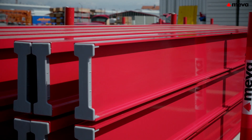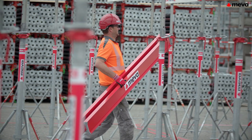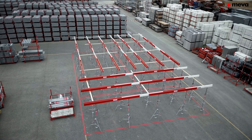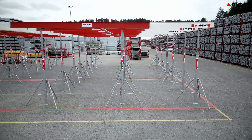The double and slide-in beams are made of powder-coated aluminum. They are light, strong, durable, and easy to clean. Depending on the beam combination, slab thicknesses up to 42 cm can be produced.